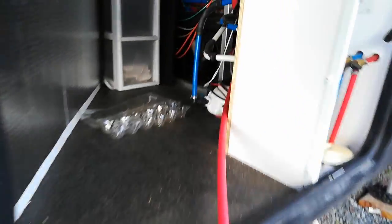I actually say that PEX pipe for routing Cat 6 cable or whatever, any cable, is actually pretty good for tight little places like this where you've got a lot of wires going back and forth, and it gives you just the right amount of rigidity plus flexibility to get through all of this wire mess. And I'm trying to route this so that I'm not crossing over any power cords, but yeah, it allows you to bend it from a distance but still allow a little bit of rigidity to aim it places. So that's what I'm doing right here.